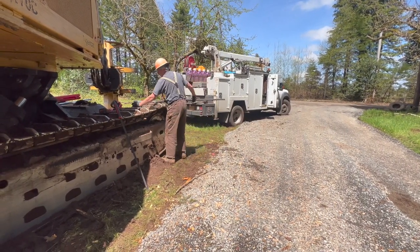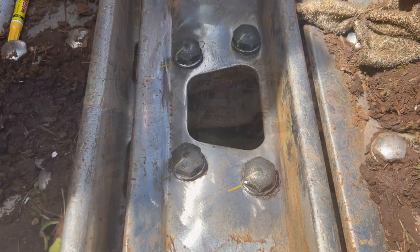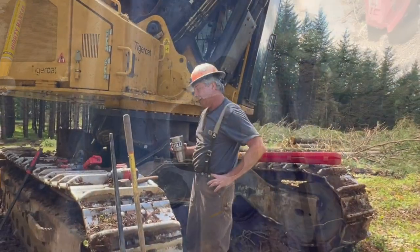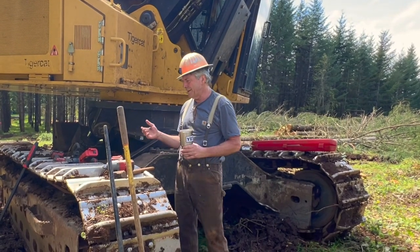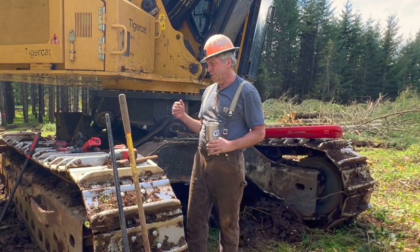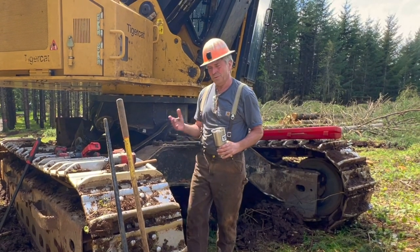Any questions or comments? I'd love to hear from people with experience on the two Milwaukee guns. Hope you enjoyed it - you can see my marks lined up there. I took these down as recommended - pulled down to 330 foot-pounds with the torque wrench and then a third of a turn to torque them to yield.